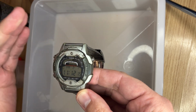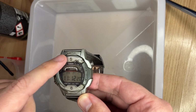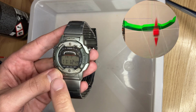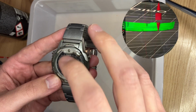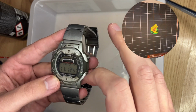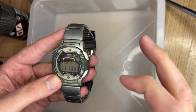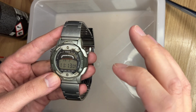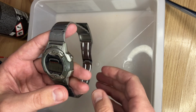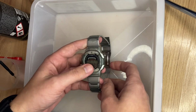It was a hasty decision on my side because I hadn't seen from the pictures that the top pusher is missing, but I have managed to 3D scan it, and I have also managed to duplicate it. Basically the pushers are the same, just mirrored, so you can reverse it and place it. I have the pushers, and I have some trials that were made before having the pushers here. Before placing them I will need to tear down this watch and clean it.